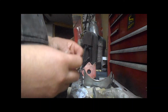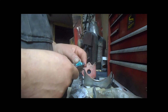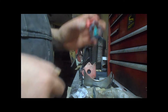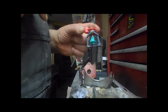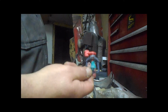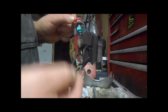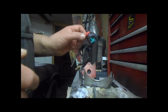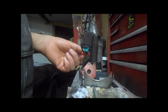Anyways, these misters here are always a pain because some of you may know that in orchards and vineyards and so forth, some of these hang upside down. You have lines along the posts, and there's hoses that hang down, and these hang upside down. Well, the problem with that is you get spiders. Spiders like to climb up things. What happens is spiders come in here, they climb up here, go up the nozzle, and you plug up your nozzle. I roughly have about 100 of these I keep on hand, maybe 50 or so.